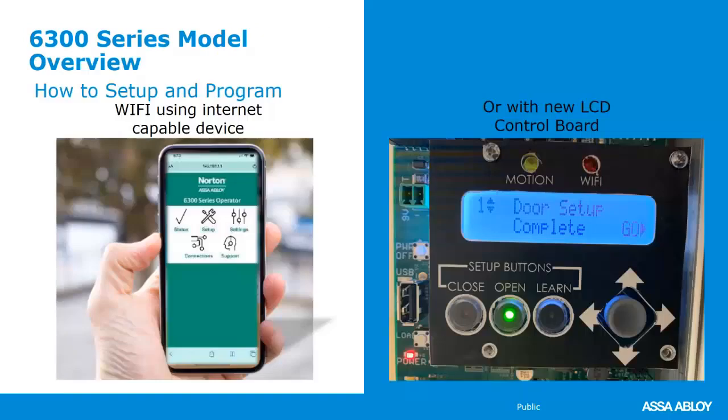So like I said, the 6300 has been out for 3, maybe 4 years, and it just went through a programming and interface update about a year and a half ago, and that's where we added the Wi-Fi programming. So let me make clear what that means if you have never programmed one of these via Wi-Fi. We're not saying that you need Wi-Fi access near the operator. All we're saying is that you can use a device that has the ability to connect to a Wi-Fi network. So that could be a cell phone, that could be your tablet, that could be a laptop that you just took there that's unplugged. Anything that can access a browser, whether you have internet access or not, it's not important.